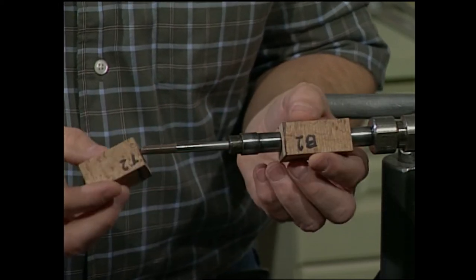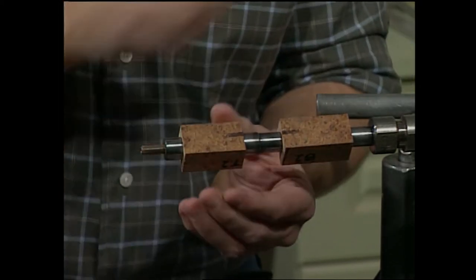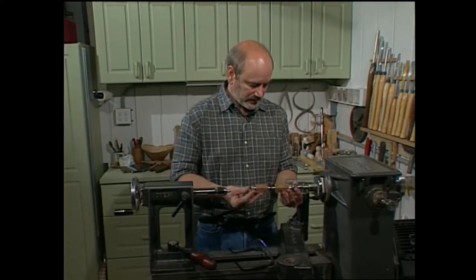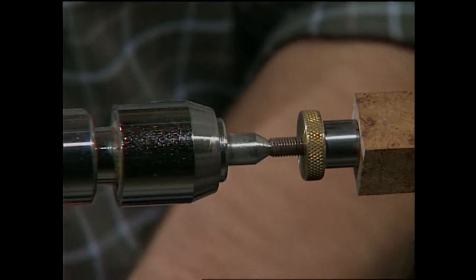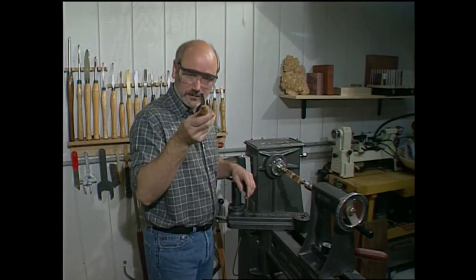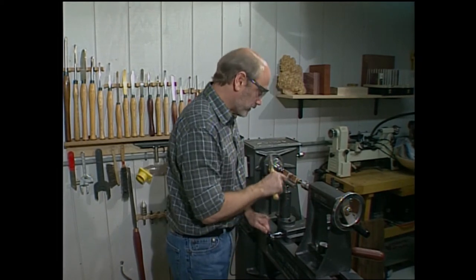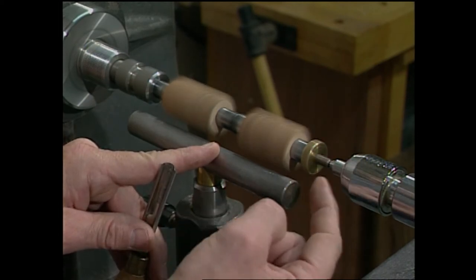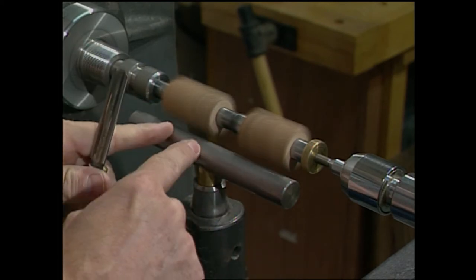We slide another bushing on — here's the top of our pen. Make sure you have those lines matched up so you've got your grain match going on. Bring the other bushing up, take a nut, put that on there, and tighten it down — that keeps everything tight on the shaft. We want to keep this on the lathe because it's a Morse taper and can fall out. They designed it with an indentation on the end of the rod — you take your tailstock and bring it up, and with a nice sharp point it goes dead center in there and centers everything up. To rough this out, we're going to use a small flat spindle gouge. It's easier to use small tools when turning a pen — you have more control. If I tighten the tailstock too tight, it could bend the rod and affect the shape of the pen.